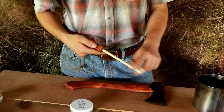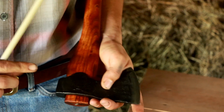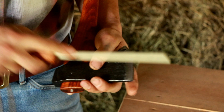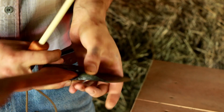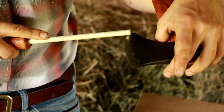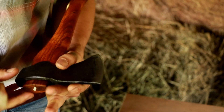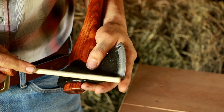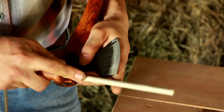So I'm going to show you how I do this. When I go to use a ceramic rod, I hold it like this on one side and then like this on the other side. I normally go away from the edge for the first few strokes, and then if I develop a little wire edge, I'll go toward the edge right at the end. You want to be very careful doing that — just use the tip of your rod and don't get too close to your fingers. I keep my index finger right at the top corner, or the toe of the axe, to keep from rounding that corner off. I run along my finger and it keeps it from rounding that corner off.